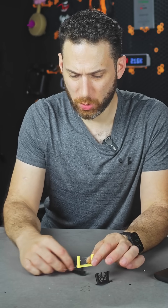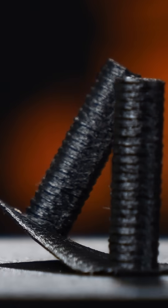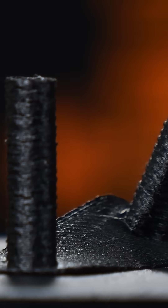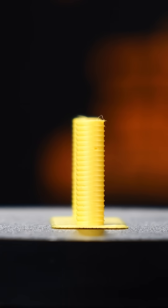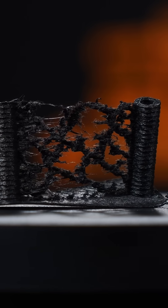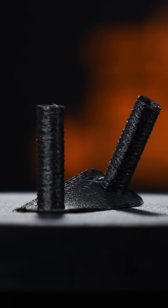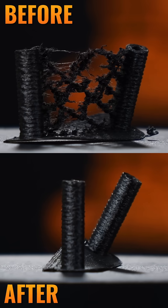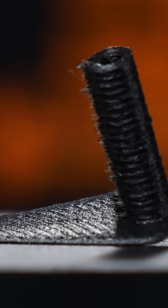I went ahead and dried these two different filaments at two different temperatures — about four or five hours for the PLA, and 12 hours for the high temperature PA-HTCF, though it may have absorbed a little moisture over two additional hours while I was away. The PLA is an obvious win — it goes from basically unprintable to gorgeous, perfectly restored. I was skeptical about the PA-HTCF because you should ideally dry these materials at very high temperatures, 120°C, and yet the before and after is incredible. Maybe 18 hours would get it even perfect, but it's pretty impressive.